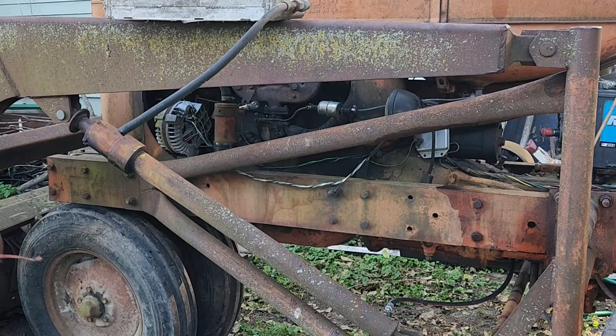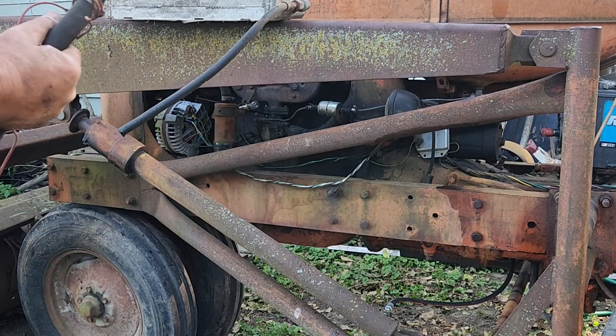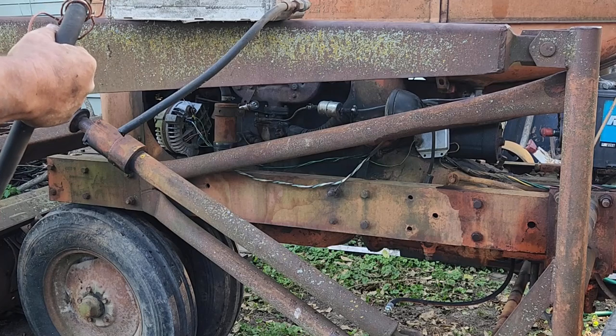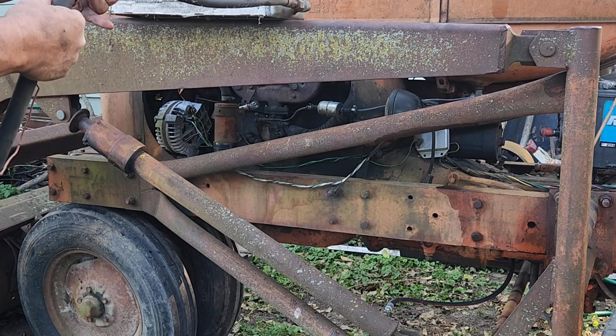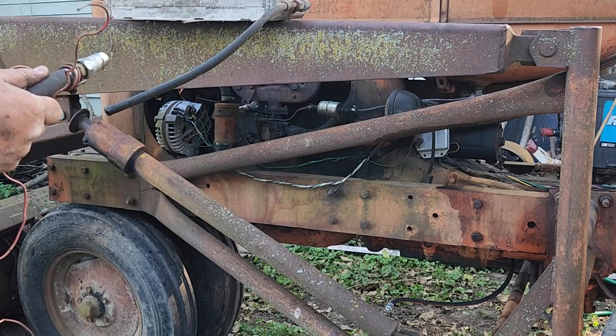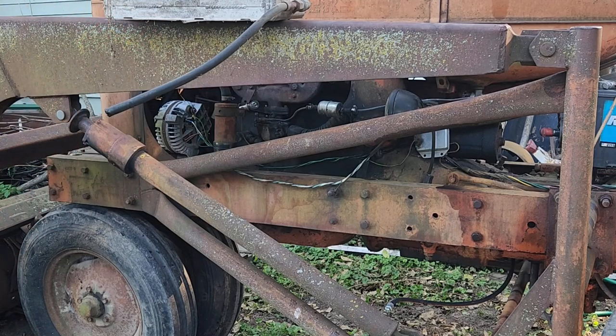This is the return line. I am going to take this off of here so I know what size, and then I'm going to get a pair that fits this hose. So then I'll be able to plug this into that, the cooler into there, and then return right through that. And when I take it all down, that core fluid can stay in there. Because the tractor doesn't have that much of a reservoir, it's going to mess it up. I mean, not break anything, but confuse it, have to add and dump and trouble. So, okay. That's the plan.